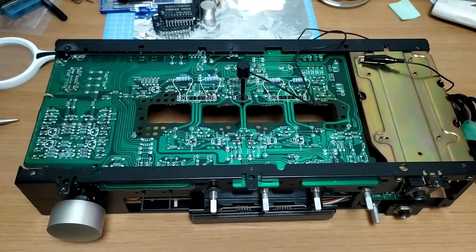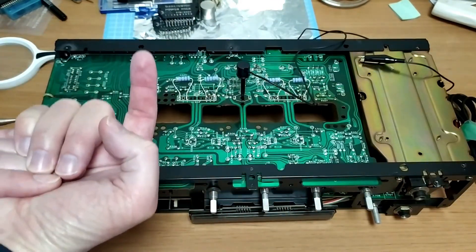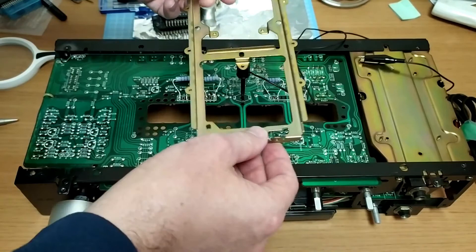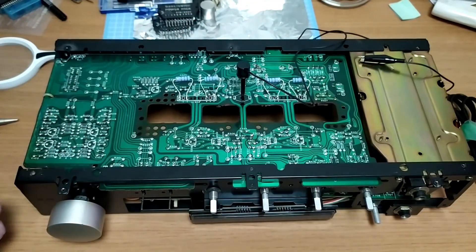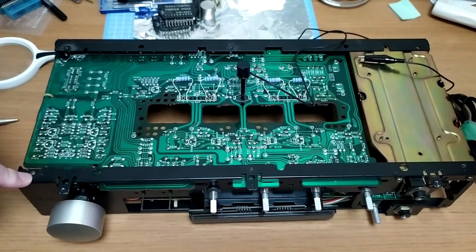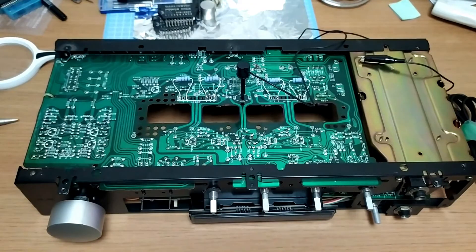As you remember, I've put some resistors in where the power packs go. I tested the voltages and they were very unexpected — I was getting like 70 volts where I was expecting 35. That didn't make a lot of sense, but 35 is half of 70, so it got me thinking that maybe there's an earthing problem — and I was correct. Where this probe is sticking up, on the other side is a pad, and that creates with this bracket here a completed earthing circuit. I'd removed this to get access to the solder pads without thinking that was a separate earthing section. There are other earths screwed into the chassis, but that one wasn't connected, so I just had to run a probe with an alligator clip to complete that circuit and now the values are looking much better.